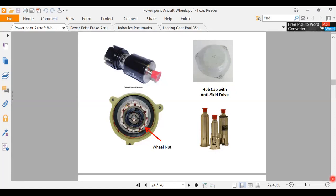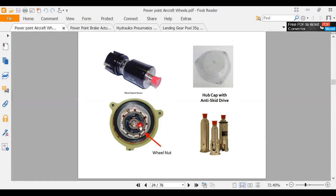So if you look at this hubcap picture here in the top right, that guy fits. See the little screw holes? There's three screw holes in that. I got one of them three screw holes. That hubcap goes on there. There's a T-slot in that, okay? This T-slot that I'm going back and forth on, that is up here on this end. So when that hubcap goes in there, a little bar goes in there, and when the wheel rotates, the axle, see the nut? The axle does not turn, but the wheel does.